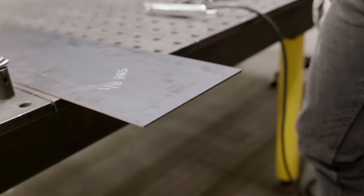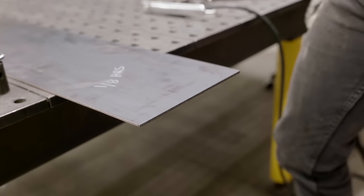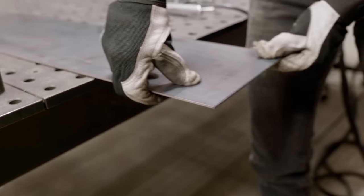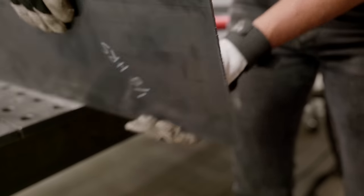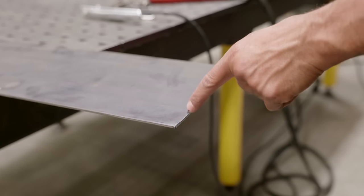I just finished a 1/8-inch cut at 25 amps with the 0.6 millimeter tip, and we've got a pretty clean cut here — very, very minimal, just the smallest little fleck of anything. Great cut, ran smooth, I'm pretty happy about it.